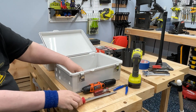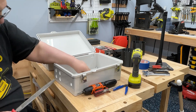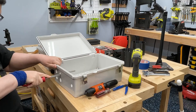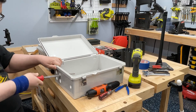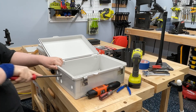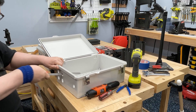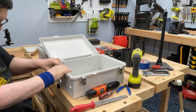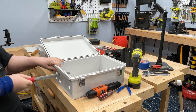That tried-and-true technique unfortunately did not work in this case, so I had to go to a more nuanced and gentle approach, much to my frustration. I'm actually building both boxes together, alternating back and forth. On the second box I decided to use a file and file out the holes a little bit, which made it possible for me to get the Ethernet pass-throughs to fit fairly well. It was a little disappointing they didn't go directly with the drill bit, but apparently a 21 millimeter drill bit would have been better than the 20.5. Still, I was able to install all of the pass-throughs successfully, and as you can see the first one fits nicely.